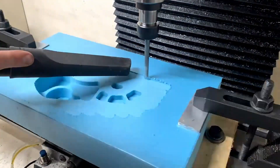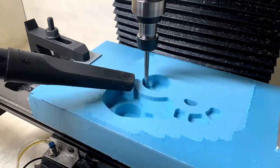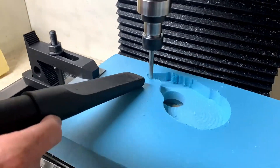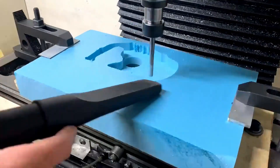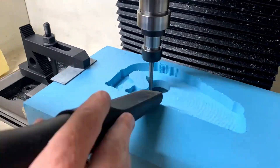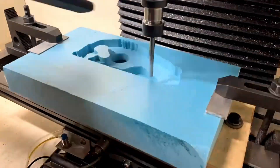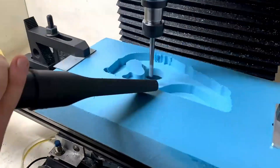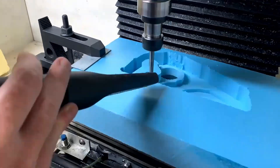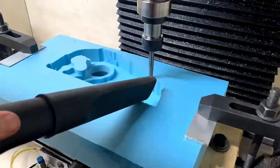The reason I'm starting with the cassette plate is it's the smallest casting — I can try a few new things. This is going to be heat treated from a known quality aluminium, and then from there I can use the manual milling machine to accurately machine all of the bearing bores on the correct centers and ream and drill any other holes required. I'm not planning on using my CNC for any of the precision machining on this cassette plate or the rest of the engine.